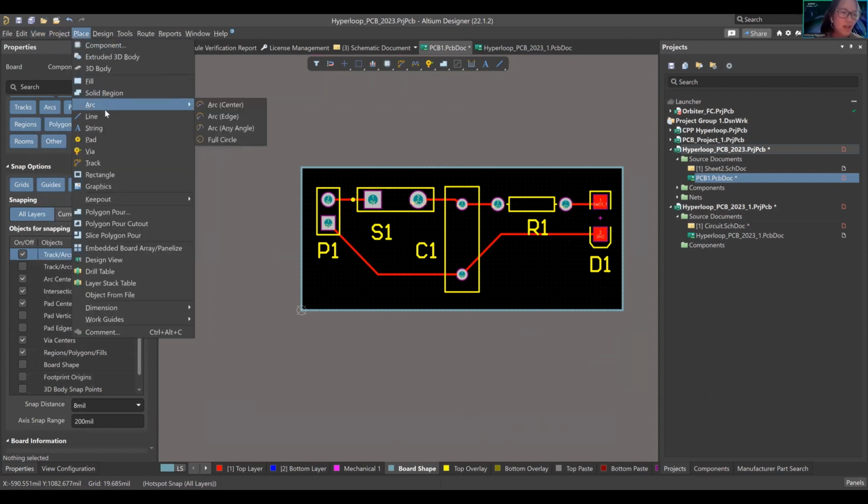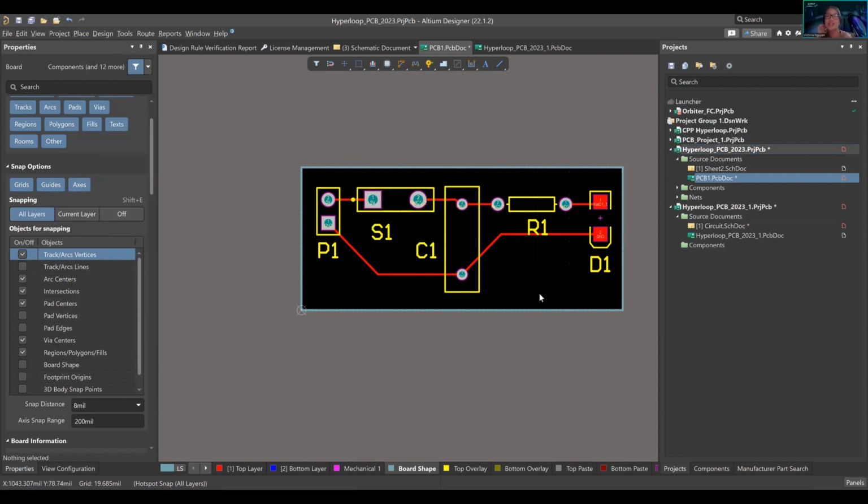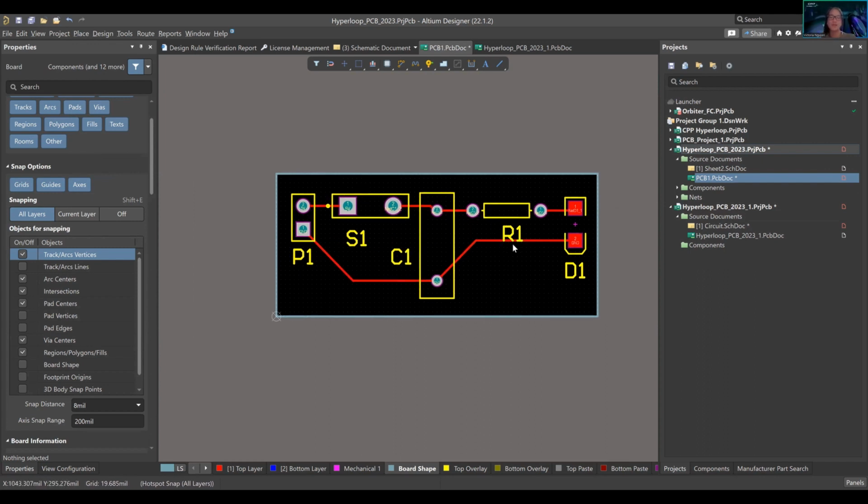You can paste an image. For example, Chris has a little ohm symbol for his company, and he'll just add in the image and place it into the board, and that will become silkscreen. You can also create an exposed version of whatever you want. That means exposed copper, so it'll literally come out as copper, and it's really cool. However, you can't fly with that board, but you can do it for ground station or ground earth stuff. So that's really cool.